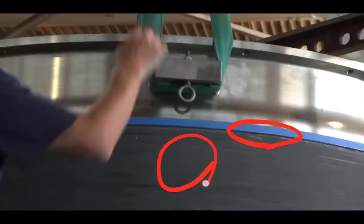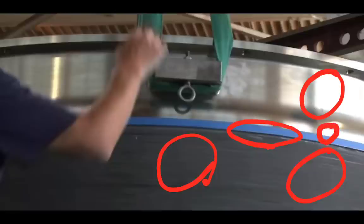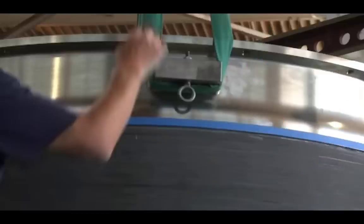You can't have flexion here. There's the engagement of the ring and the vessel — the part you're living in — held together by just that little lip and the glue, then the pressure compressing it together. You can't have flexion or water comes in. Unless they plan on wrapping more carbon fiber across this transition zone to tie them together, all that's holding these two is that recessed lip, the glue, and the glue's behavior under temperature cycling.